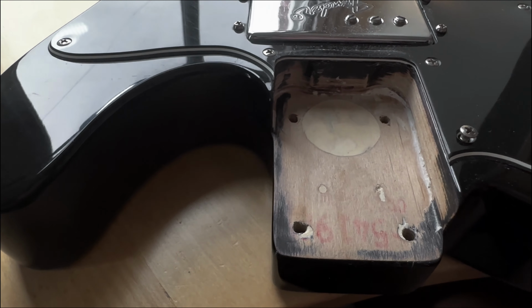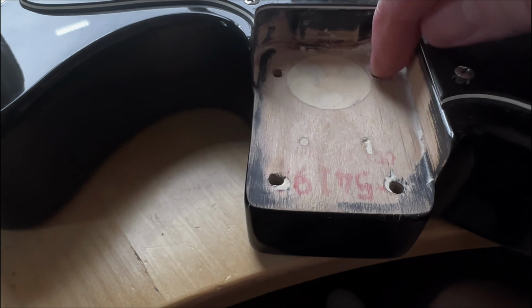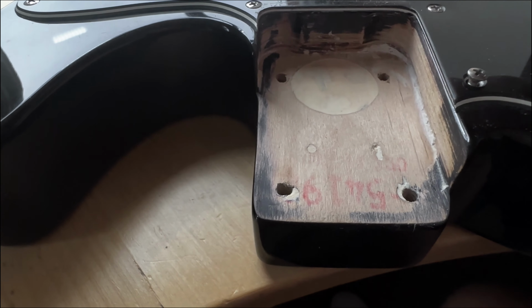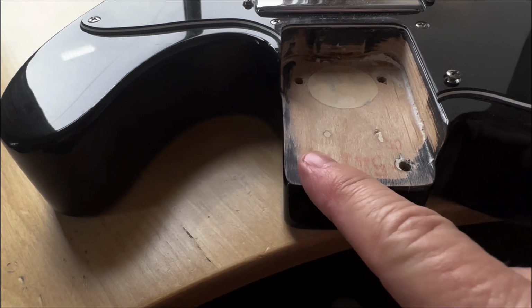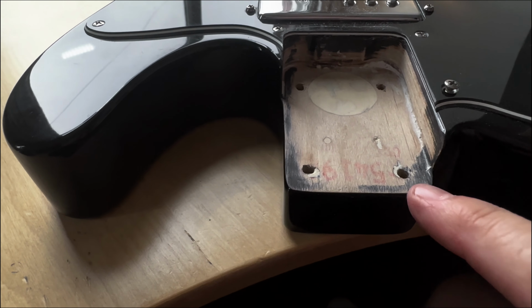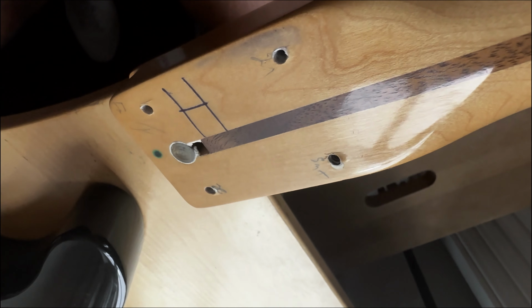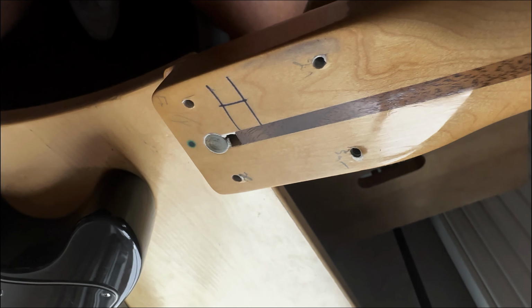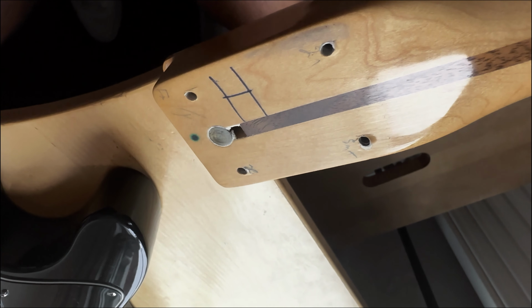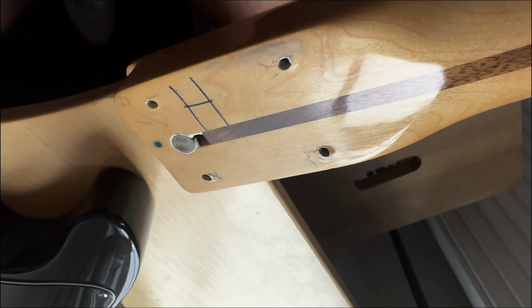And my view, going back to guitar resonance, is you need maximum contact between the back of the neck and the body. So I always make a point of sanding out these bits where there's been paint overspray, and also roughing up or keying the bit where it joins the body, because I think you want maximum wood to wood, so to speak.